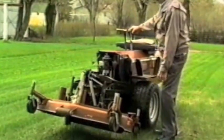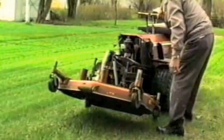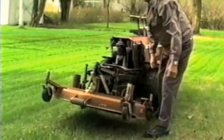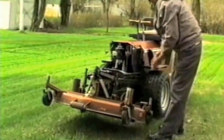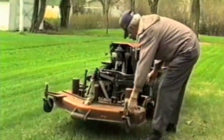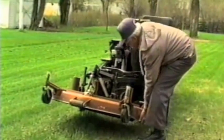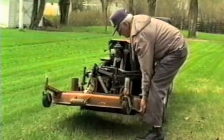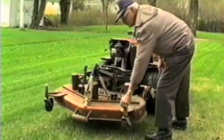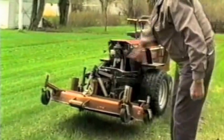To service it, you simply lift the loader arm and tilt back, and you can get underneath and service it, wash it out, whatever you want. It's a GE 36-volt DC electric mower with a 42-inch deck. Two more casters were added because of the way it turns. It has spring-loaded struts, vertically and horizontally, and it freely floats to follow the contour of your landscape. It's got three blades, and each blade has its own motor.